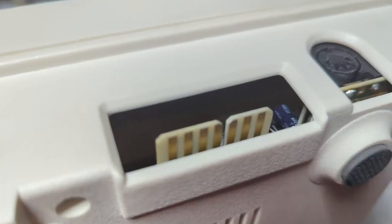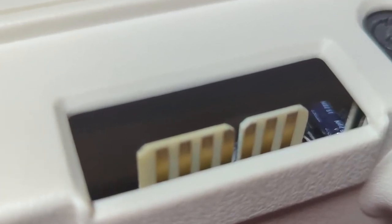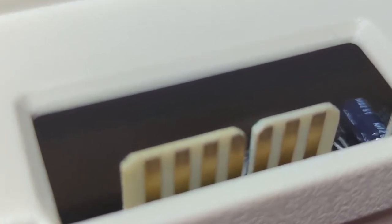So cassette storage in the 80s was generally based around consumer-grade cassette tapes and consumer-grade cassette decks. Some systems, on the other hand, like the Spectravideo, customised their cassette decks slightly. The Spectravideo, for example, has its own custom 7-pin interface that carries power to the cassette deck, so you don't need an external plug pack. It carries audio from the deck into the system for playback and so on. The cassette interface itself is a 7-pin edge connector on the back of the 328.